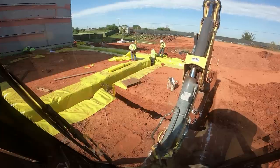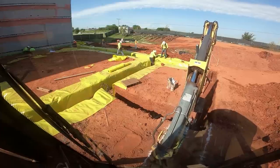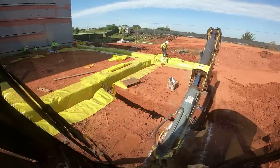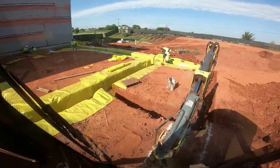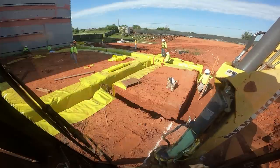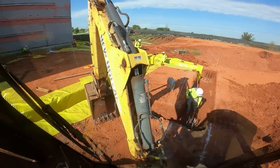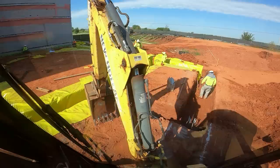I think that's one reason I enjoy it. There are jobs where you have to be non-stop all day long, as fast as you can go — and sometimes digging is that way. If you've got a lot of ditch to open up and guys following you to tie steel, they'll keep you hooked up all day pretty hard. A lot of times I don't run my machine real fast. Right now I'm running a little slower than normal because we're dealing with a lot of corners. When you're cutting ditches and getting them three or four inches too wide, that wastes a lot of concrete.